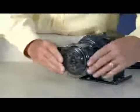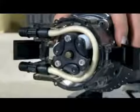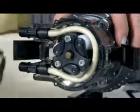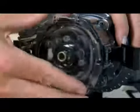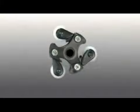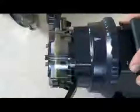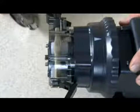Remove the tube housing cover and flip it to use as a tool to expand the roller assembly. Align the center of the inverted cover with the center of the roller assembly so that the three holes on the face of the cover align with the three knurled lugs on the roller assembly. Position the cover feet near the bottom. The roller assembly needs to be expanded so the tube is pressed against the tube housing wall. Hold the feed rate control securely. Use the cover as a wrench and quickly snap — rotate the roller assembly clockwise to expand it. The tube will be pressed against the tube housing wall.